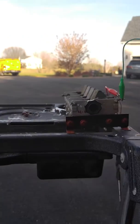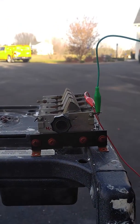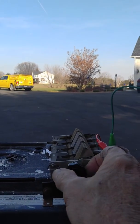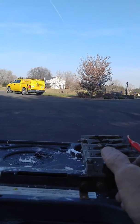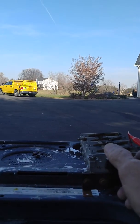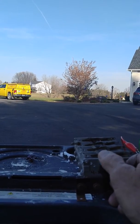There's something else I'm going to show you, which is kind of interesting. The capacitor is resonated right now to 1460. If I increase the capacity, the signal strength goes down. And if I open the capacitor up — basically no capacity, 50 pF — the loop is basically untuned, so it'll pick up all bands, but it still exhibits a reasonable amount of directivity.